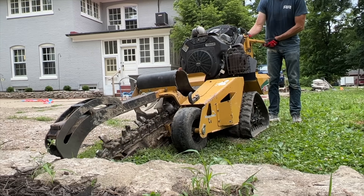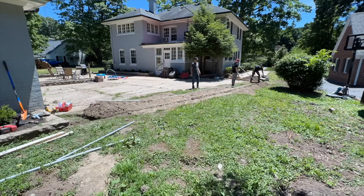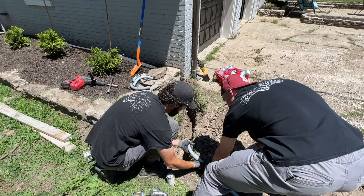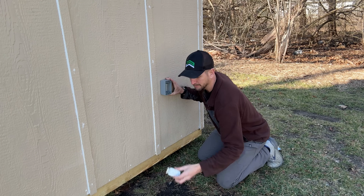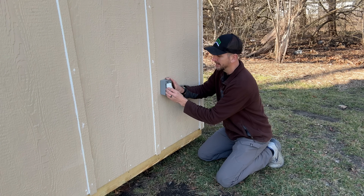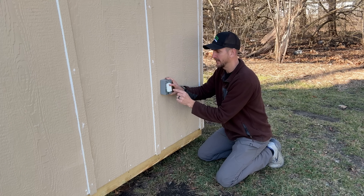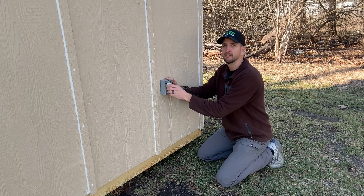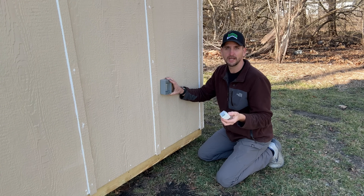That previous project shows pulling a 240-volt 60-amp circuit to a sub panel — it'll show you how we were running conduit, how deep we were trenching it, and give you some of those details. So you could come up through and what I want to do is have a GFCI outlet here with ground fault protection going into the line side. I'm going to feed that 20-amp circuit into the line side of this and pull all the power to the shed from the load side. So everything in the shed including the lights will be GFCI protected.